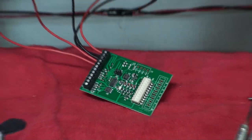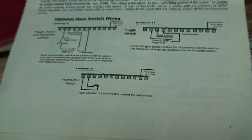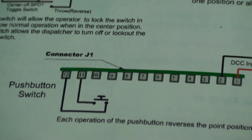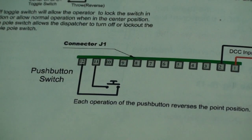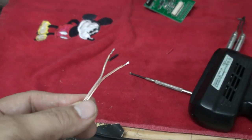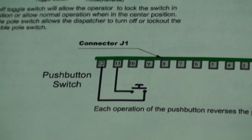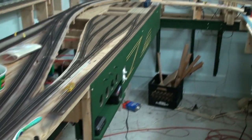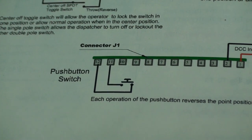A couple of you have been asking about manual override on the tortoise HARE combination, and that's what I'm going to show you now. In positions 12 and 11, you can use any of the other three that they indicate, however I like to keep it simple. I will connect a 24 gauge speaker wire, which I've tinned the ends to make it easier to insert into the HARE connector, connected to positions 12 and 11. That wire will run out to my front panel and I'll have a push button switch connected to it.